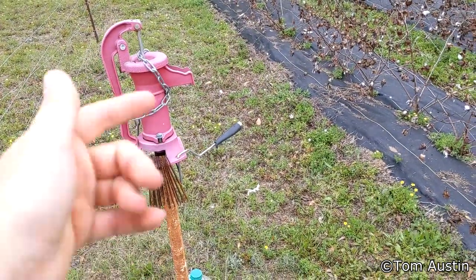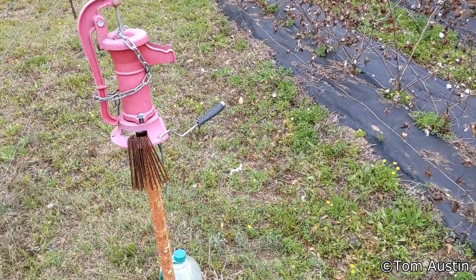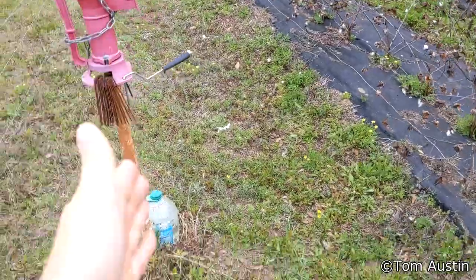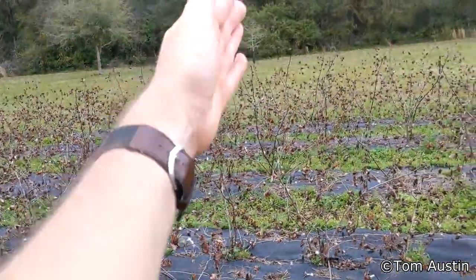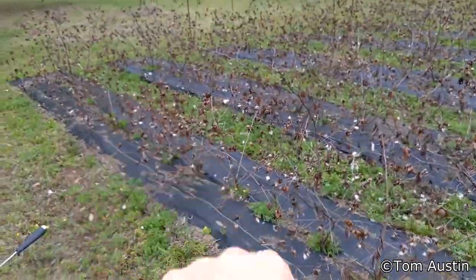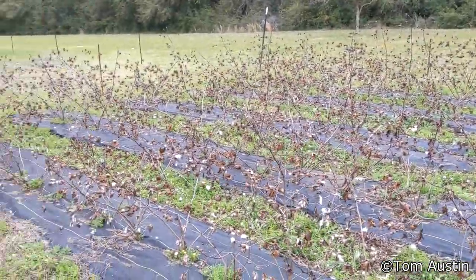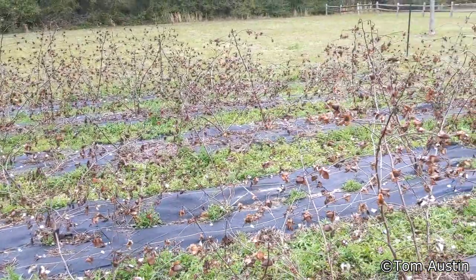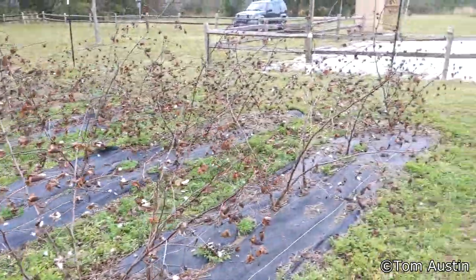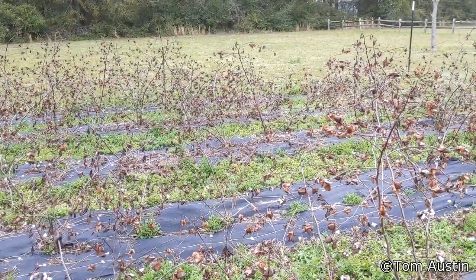And additionally, have that run up to a whole irrigation system head: filter, vacuum breaker, pressure regulator. Actually, I'm not doing a vacuum breaker, but pressure regulator, filter, timer, all that stuff, and then run down in a 1/2-inch poly tube that'll run right up through the middle of the garden. We'll have a walkway in the middle where we'll skip a plant, and then that'll go to 1/2-inch emitter line with 12-inch spacing, and then every 24 inches I'll put a plant, and that should irrigate everything more than sufficiently. That should basically eliminate all of my needing to weed or water anything, and the plants should consistently get up to about what I had the first year, about 7-8 foot.